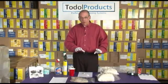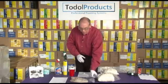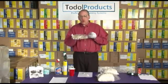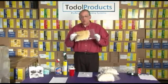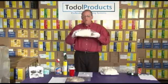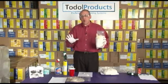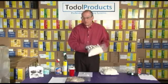Here's a simple test to show you what I mean. I took two clear plastic bags. This one I foamed, zipped up the bag as fast as I could — no moisture — and you can see it's moisture starved. It breaks down to its resin state. This one, same thing: grabbed the plastic bag, spritzed it with water, foamed in here, fully cured. It only needs an ounce of water, but moisture has to be present when you're foaming large cross-sections.